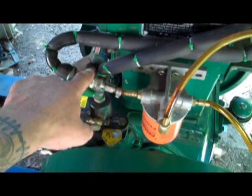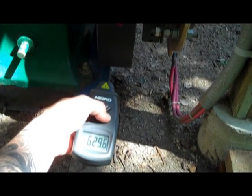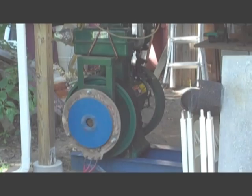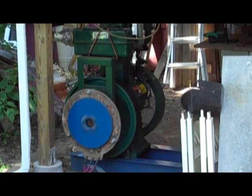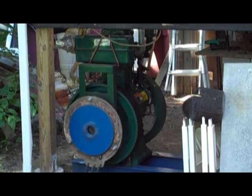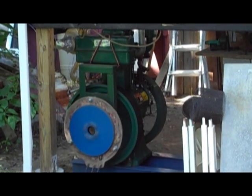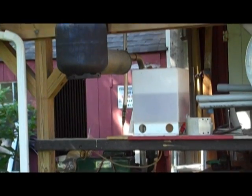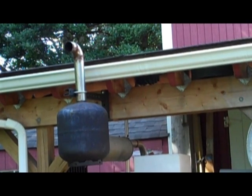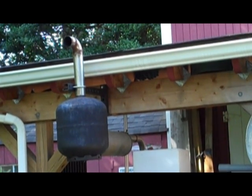We've got a changeover valve here to run on vegetable oil. Let's check on the RPM — we're running about 630 RPM. Here's the other side of the engine. You can actually see the axial flux alternator on the front of it. See how we have three-phase power coming out the bottom — that's what feeds over to the rectifiers and then into the MX-60 to do the power point tracking on the alternator. If you look up, you can see I constructed a muffler out of a propane tank. A lot of people in the off-grid community like to make homemade stuff — you can get a homemade muffler that works pretty good and quiets the thing right down.